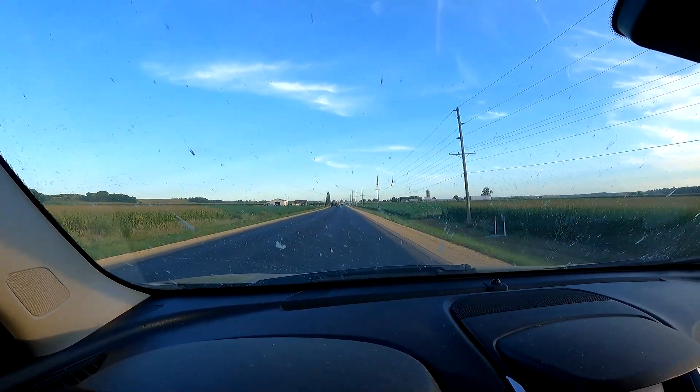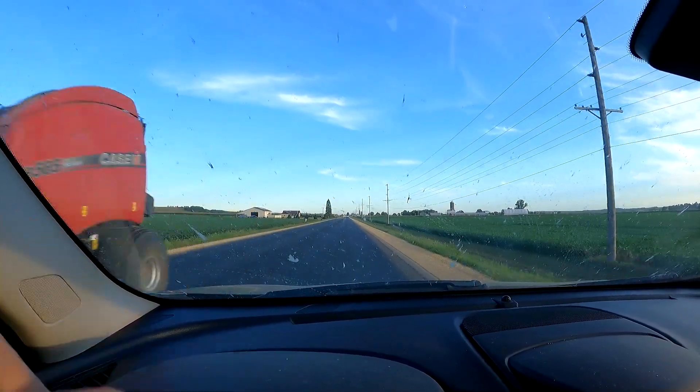Here comes Nathan with our 565 premium round baler. With the SureTrack system we have six bins hooked up, all connected to the cloud with cell modems that pump up data in real time. That gives us the ability to check it in real time, control fans, control burners and heat. We have it on five bins that typically have corn and one bin that typically has soybeans — and the soybean bin this year is what made us money. We put in grain averaging around nine and a half percent moisture and sold at an average of 11.6 percent — that's over two percent of moisture added back.